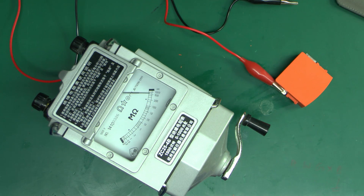Regardless of what speed we actually turn the handle, that's how these surge protection devices work. A very simple thing - basically it's just a very high resistance normally. When the voltage exceeds a certain level this thing will then conduct, which serves to clamp the voltage to prevent it exceeding a certain level so it doesn't go into the installation and cause damage. Because it conducts, the energy from that over voltage goes through here and is dissipated as heat. Nothing particularly mysterious about these things - they're a very simple principle. These things do wear out, hence the indicator on the front to show when it has failed and requires replacement. That's it for this episode - there will be further ones on how to select these things and what types are available. Thanks for watching.